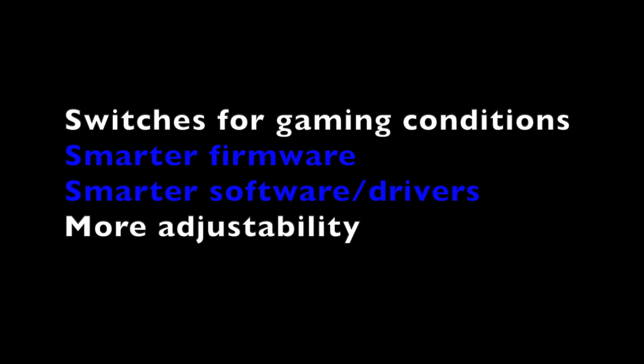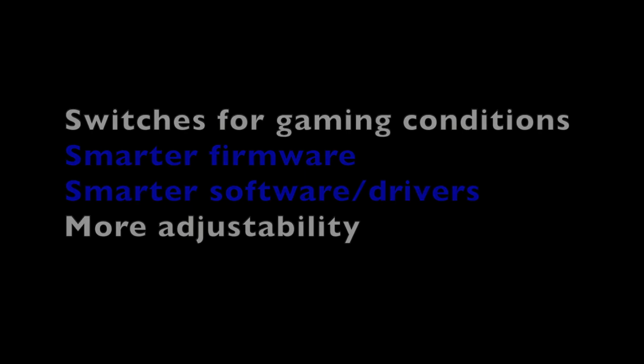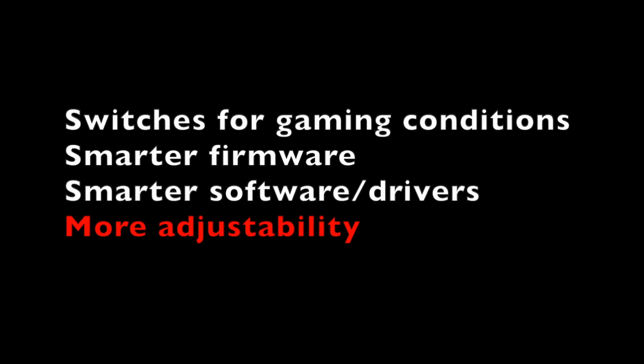Furthermore, if you're really smart, you could program it so that it detects if you're clicking and dragging and then really lengthens the time. And then if you're fast clicking, it could also change to another algorithm so that it's going to extend the bounce period there as well. And you can even make that adjustable on a user basis.